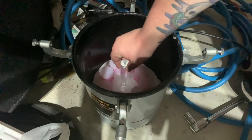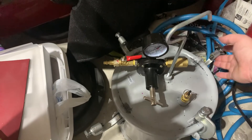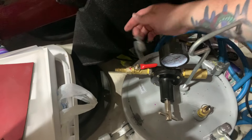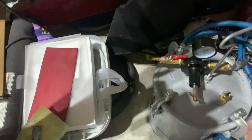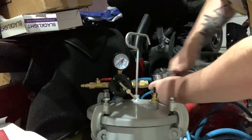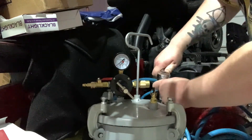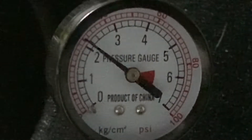Go ahead and put it in the pressure pot. You're going to want to put the lid on and get ready to tighten down all the clamps. Tighten the bolts down as hard as you can to make sure that no air leaks out. This is a fairly cheap pressure pot, so it's really important that you make sure everything's tight or else you're going to get an air leak. Once all your clamps are tight, fill it up to about 45 psi and wait a day.